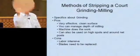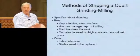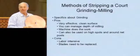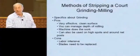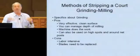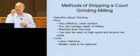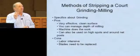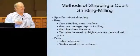And then you've got a metal one. These metal ones have carbide welded onto them. And this will take most anything down. This is also good for when you come across, not if, when you come across cracks that have been filled numerous times, and now you've got a speed bump. It looks like a small crack on top, but when you take that speed bump down, you're going to see a big wide crack underneath. Something like that will take that right down, saves a lot of time.